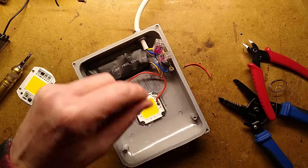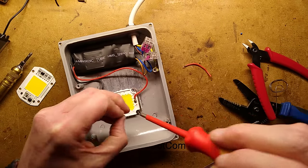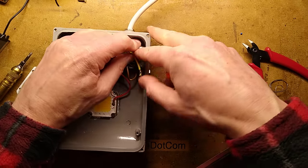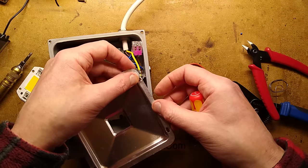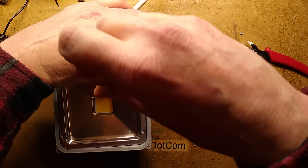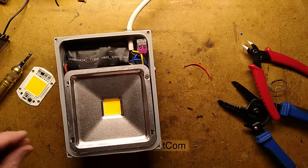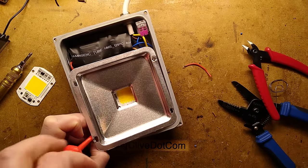Right, I'm going to put the reflector on this — I'll do it right now. There are only two screws, being the classic Chinese product. The earth is actually just pinched under here, so I'll try to pop these terminals down. I'll rearrange everything a little bit inside, and the earth will now not want to stay put. I'll put a screw through here and through that — this is where it gets fumbly. The wire's going to want to control where the screw goes. I think that's it — in position now. Is it screwing down? Yes. Is the wire trapped? Yes — not an ideal electrical bond.